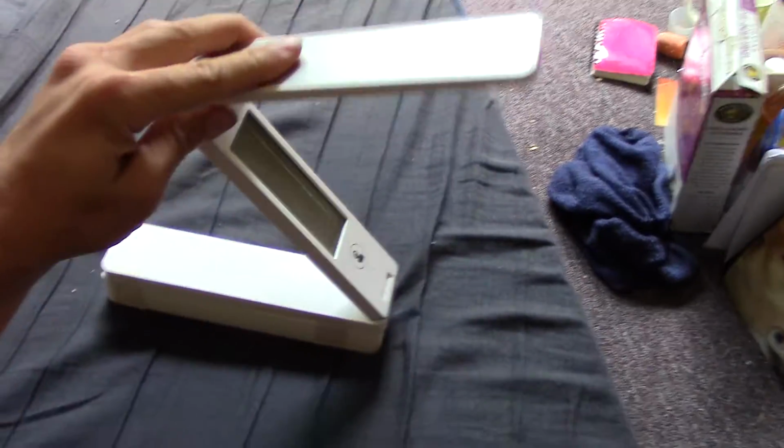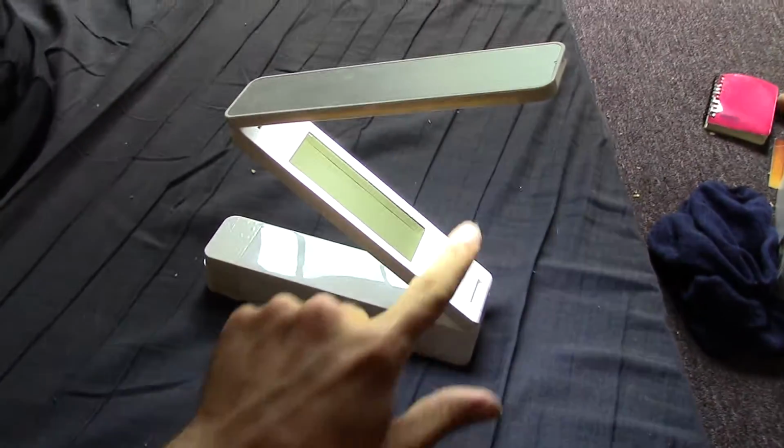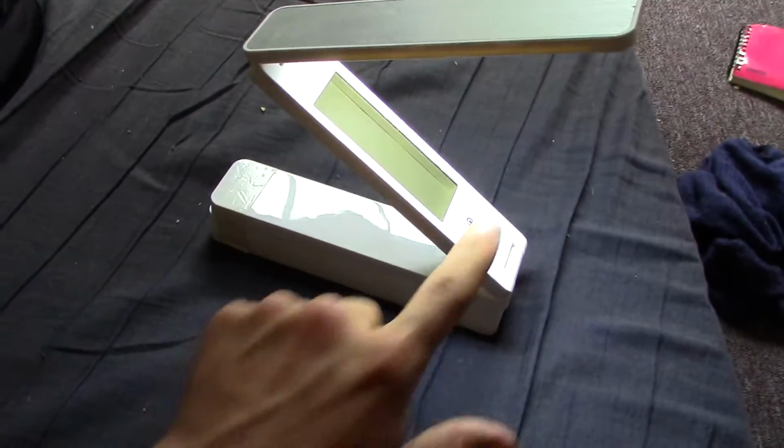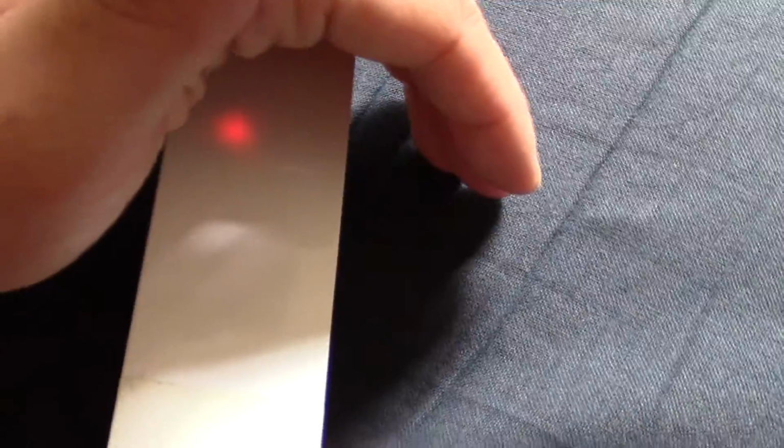And there it is. Turns on. It dims. Turns off. One cool thing that I designed almost by accident was the charging indicator. I don't know if you can make that out. Yeah, there you go. It's cool. This plastic is white and it's thin enough that the LED will actually shine through it. That's pretty awesome. Also, there's a red LED for the step-up converter when it's active. So when I turn this on, that goes on too. You can see it through the case, which is really nice. Nice little indication without having to drill holes.